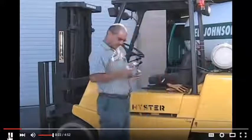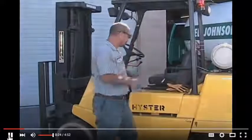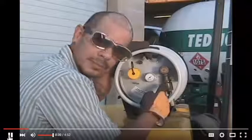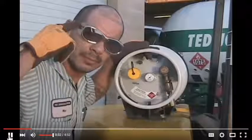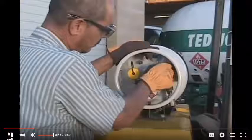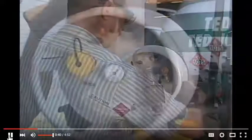It's a good idea to have your gloves and eye protection with you so you're ready to go. Your eyes will only be a few inches from the service valve connection. This connection is pressurized and it's possible for a quick burst of liquid propane to escape when disconnecting. Wear your eye protection at all times.